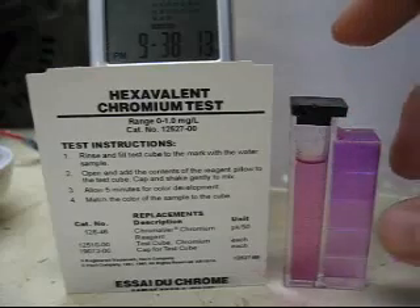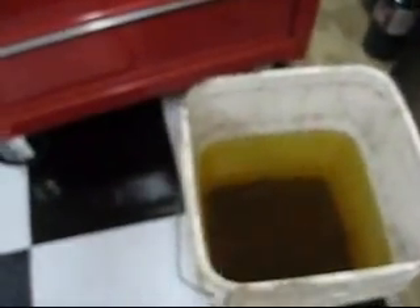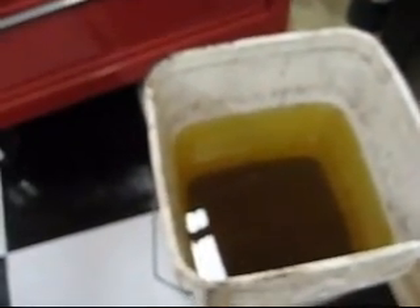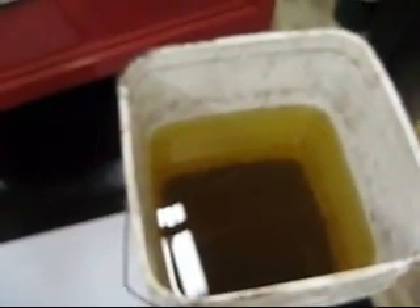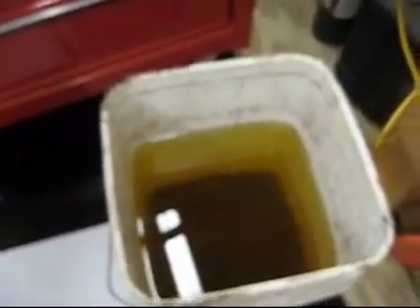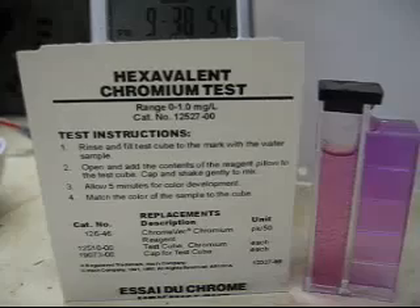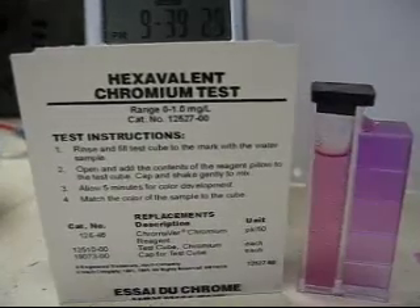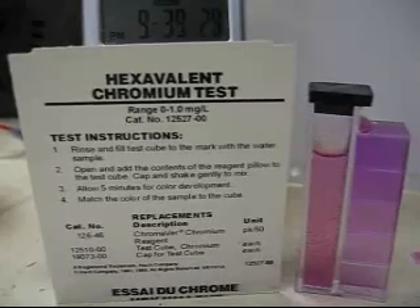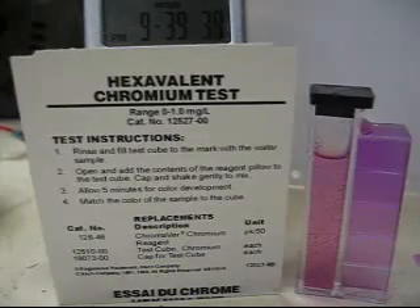So let's call it 0.5 milligrams per liter — half a part per million of hexavalent chromium in this little bucket of waste water. I've been saving this and actually using this water for some of my runs in my cell this past year. Just in case it did contain hexavalent chromium, I'm not creating more and more of it — I might be creating a more concentrated waste, but at least I'm not generating more. So take these conditions seriously and save your waste water to dispose of it properly. You might check back with the Zero Fossil Fuels site — he might have some info on that. I just wanted you to be aware that there is hexavalent chromium in the electrolyte water when you use stainless steel plates. If you have any questions, just shoot me a comment or an email. Thanks for watching. Over and out for now.